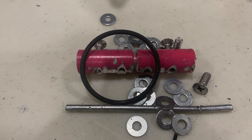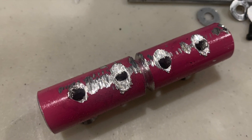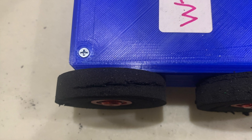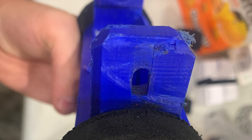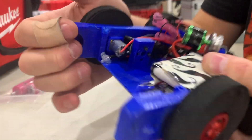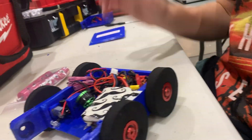In terms of damage, the bar was completely destroyed — the spinner on Taserface had basically sawed into it and gouged out some nice big chunks of the aluminum. He also got a nice cut into one of the back wheels along with a couple chunks of the outer wheels. The hole for the weapon axle had grown bigger, and the chassis had ended up splitting, which was some serious damage. My weapon motor also came loose, and one of my drive ESCs died shortly after this fight, though that may have been damaged when I was trying to get everything switched into a new chassis for the rumble.